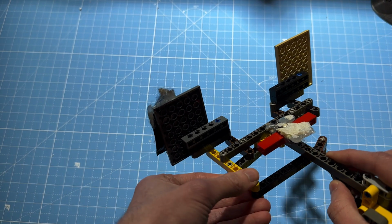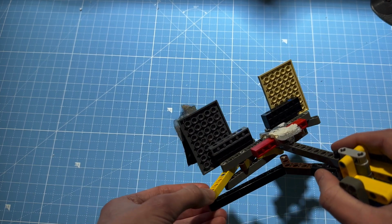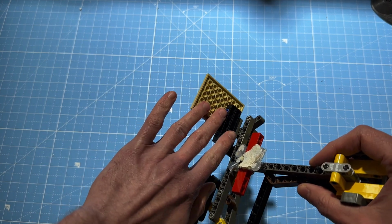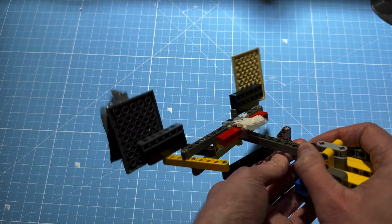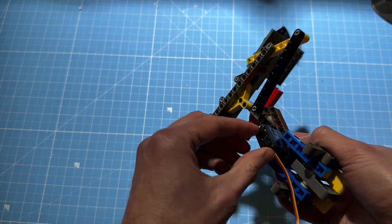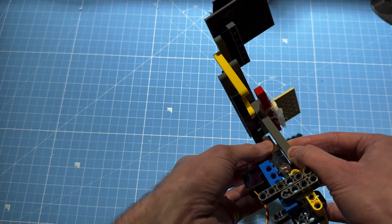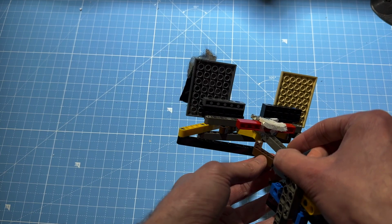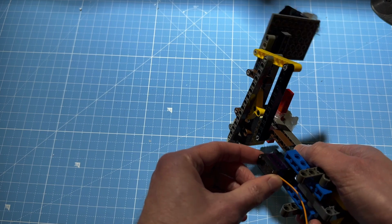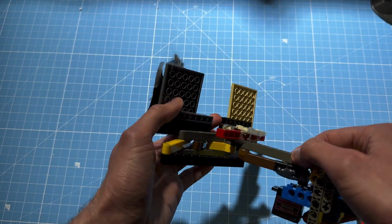The first generation of Portia used a mechanism like this to basically put doors in front of the tube, and then the candy would fall against that door, and we'd be able to snap it open real quick, snap it closed again to let some candy through. This little servo motor on the bottom would turn this arm and make those doors open and close. This worked pretty well, but I burned out servo motors, and the whole thing got a little bit rickety by the end.